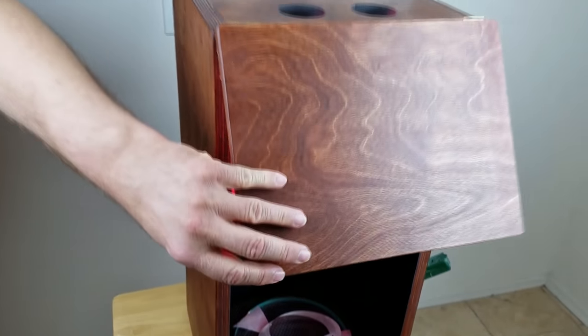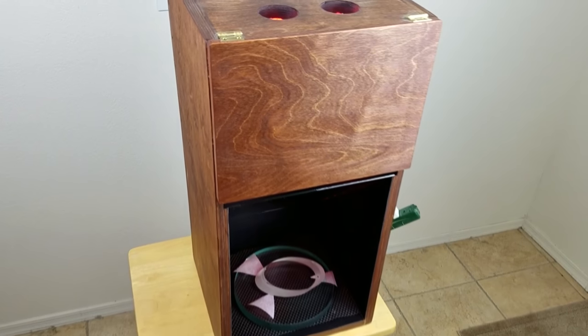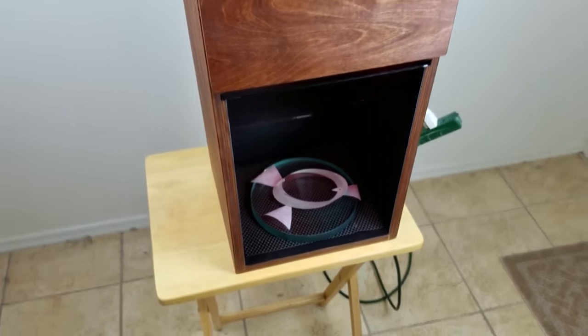To use the interferometer, you just close it up. I'll turn out the lights so you can see the bands on the mirror. This is the actual view of the mirror under test in my Newton interferometer — the elliptical secondary mirror is sitting on top of my test flat, and you can see the bands on the surface through the mirror.